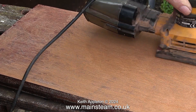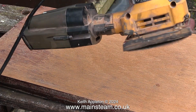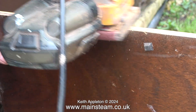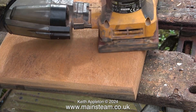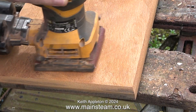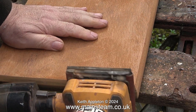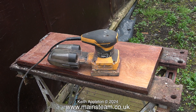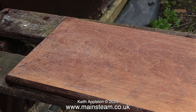In the end I cut up a piece of sanding belt — a four-inch wide piece of sanding belt that I would normally use on my belt sander. This did remove the varnish but clogged up frequently, and I got through a whole four-inch belt sander belt before all the varnish was removed. I'm outside my workshop for this job and the piece of wood is resting on a very old Black & Decker Workmate, which is well past its best. The big problem was that as the sander clogged up it started unevenly scratching the surface.